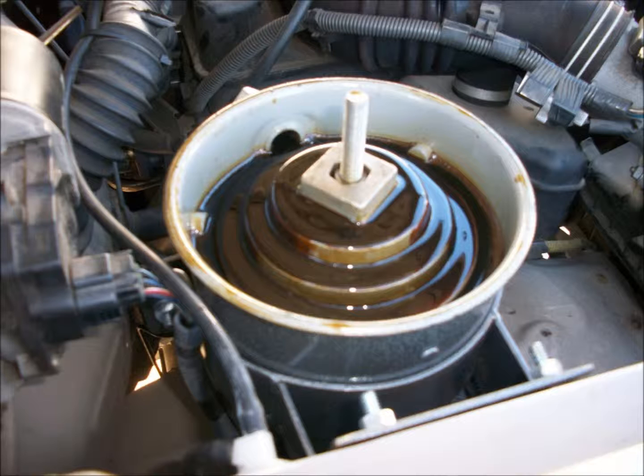Once the oil is flowing, adjust the regulator valve so that a slow, even flow of oil covers the step dispersion plate at idle. Once this is established, run the engine at high idle to ensure that the canister will not overflow. If you notice the canister filling up, readjust the regulator valve on the bottom of the oil refiner canister to slow the flow rate. For this application, one half turn open of the flow regulator valve is the normal setting. Return the engine to idle. Reinstall the heated lid using a rag or a glove. Install the washer and wing nut provided — hand tight is fine.